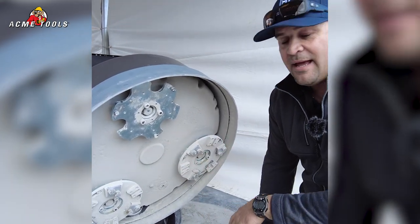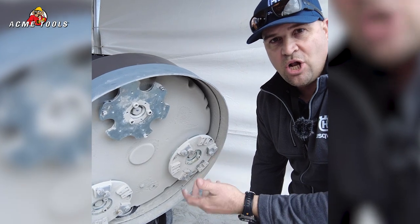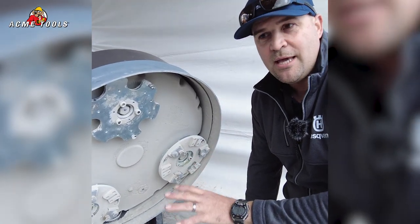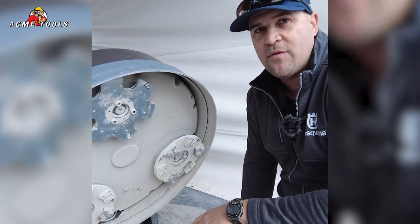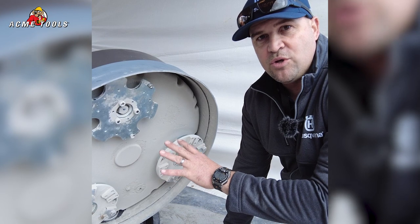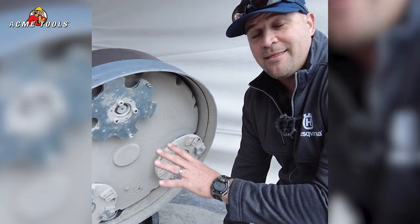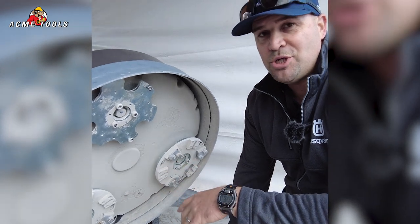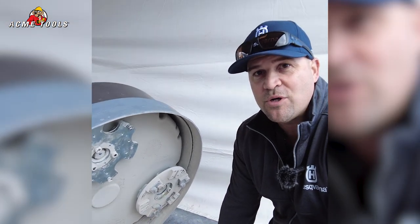Again, I think at the end of the day, it's all about having a machine that, as an operator, you feel the confidence that you can sustain service and operations to keep it running for a long time. At this point in time, for our service intervals on the belt, we're suggesting 1,000 hours at a minimum. Most of these machines in the field have been running upwards of 2,000 or 3,000 hours in between belts.